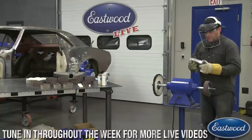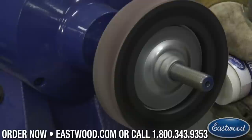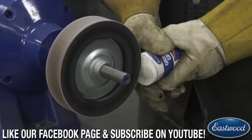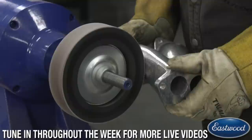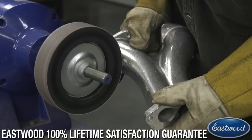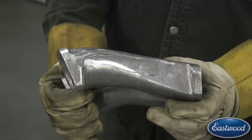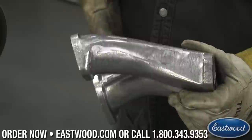I'm going to jump through a couple steps real quick with this and show you changing the bands. I'm applying just a little bit of grinder's grease on here — this is going to help with the cutting power. Now I'm going back and hitting this area, blending in this section. See how much quicker we're cutting with that grinder's grease? Already I'm really rounding that out. Putting the same weight into the wheel as before, but it's just working a little quicker because it's not clogging up that wheel with the aluminum as much.